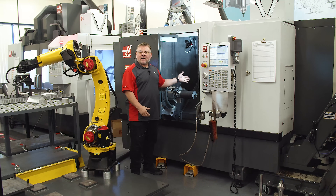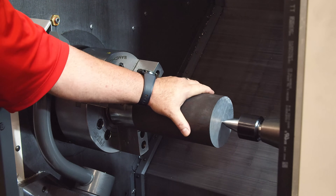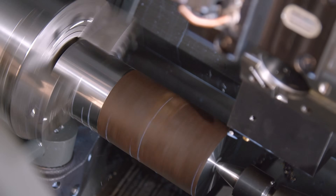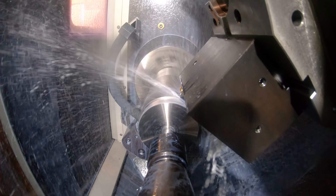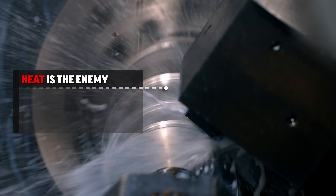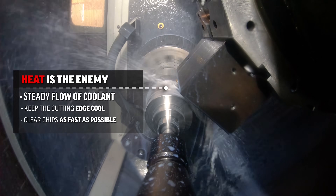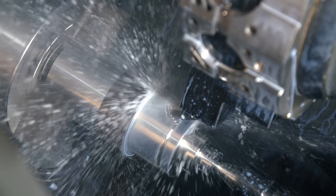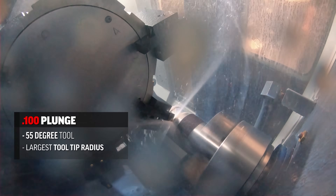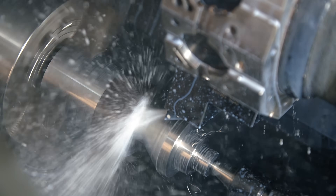The piece of raw material is loaded into the spindle, the turning tools are loaded into the turret, and we're basically ready to go. This piece of material weighs 54 pounds and we're about to remove 20 pounds of material in 10.5 minutes. We would have preferred to run dry, but with this type of hardened 4140 it's just not possible. Heat is the number one enemy of tool life — the faster the RPM the hotter the tip will get. We recommend a steady flow of coolant to keep the cutting edge cool and clear chips as fast as possible. This part segment requires a 100-thou or 2.5mm plunge per side at the beginning of each pass. We are using a 55-degree tool with the largest tool tip radius possible. This plunge feels aggressive but the tool will withstand it — we are doing nine plunges per part for this feature.